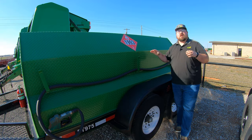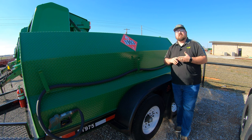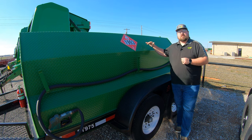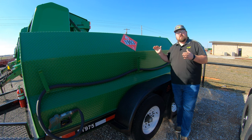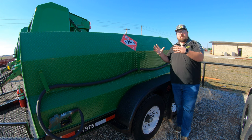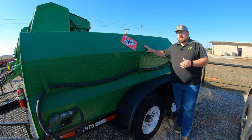Moving back to talk about the tank — let's talk about capacity. The model number is FT-975, which indicates this is a 975-gallon tank. It is made out of seven-gauge steel all the way around from the floor to the top, and it has two baffles on the inside. These baffles keep the fuel from sloshing back and forth when we accelerate or stop, reducing the momentum of the fuel pushing on the trailer and vehicle.